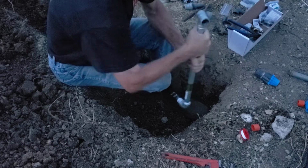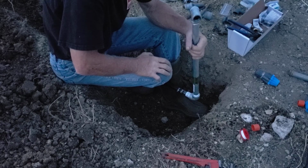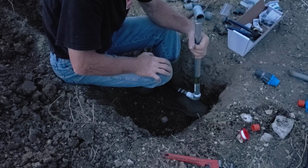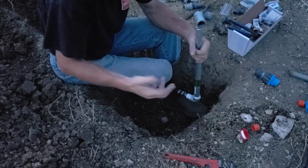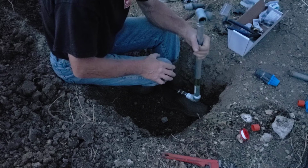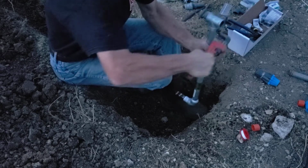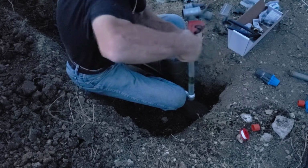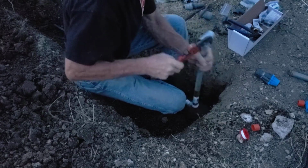At the end of the season, we hook up a massive air compressor to our entire yard system. This is a full acre, 3/4 plus a quarter. And I can turn that air compressor on at the front of the house and blow 120, 30, 50 pounds pressure all the way from here to here and blow all the water out of this system. So I really don't need a curb key drain at the bottom of this, but it would just be fancy. And curb keys are $40, you know, so it'll save me some money. Right there.